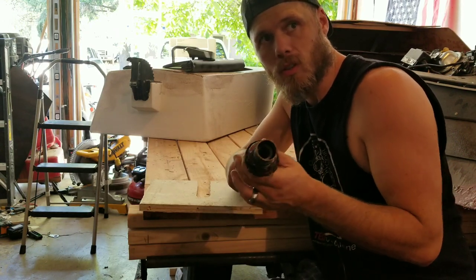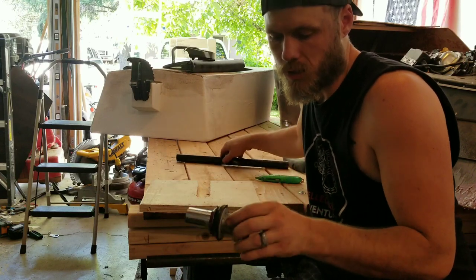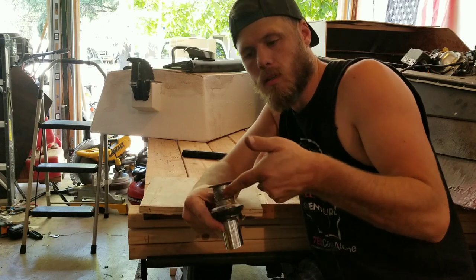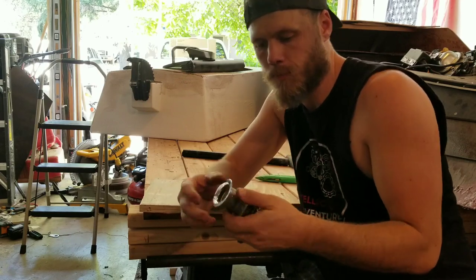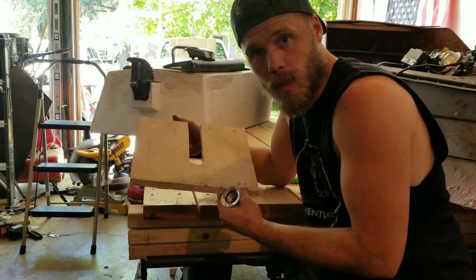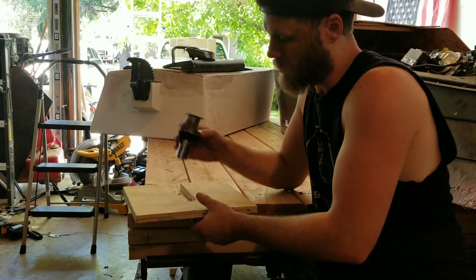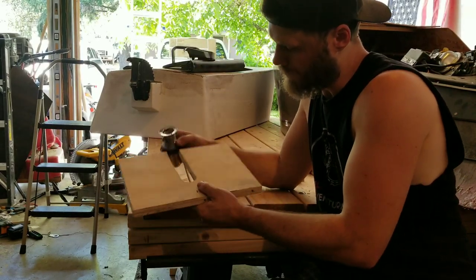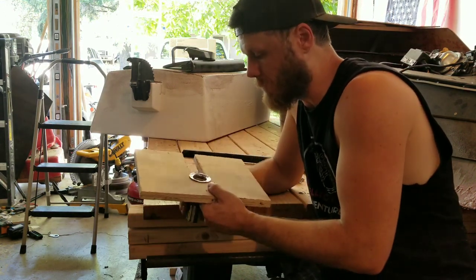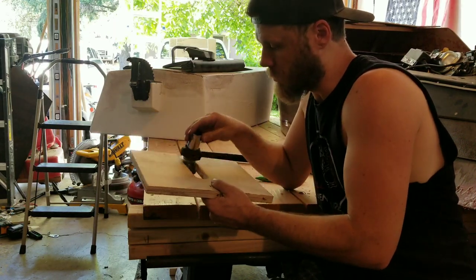The plastic drain's outside diameter is the same but the inside is smaller, so the shaft won't fit through it. The metal one is a little loose but the plastic ones are just too thick — that's one tip. The other tip is to get one without the little hole for the stopper plug. Then you drill a hole through the bottom of your boat — as scary as that is, you've got to do it — and put this through there.